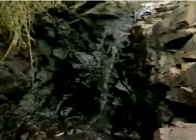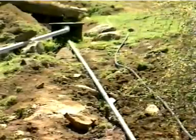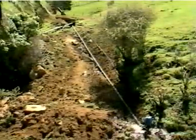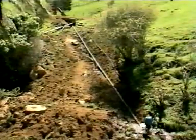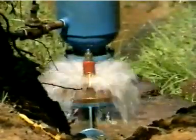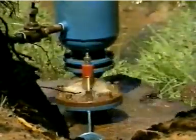However, if you've only a limited supply of clean water, it may be possible to pump it using a nearby supply of dirty water to supply the energy. There's a second requirement: the water used for pumping has to be discharged somewhere below the level you take it from. It's this fallen level that supplies the energy used for pumping. Even with only one metre of fall, you can pump water to a height of 40 metres. You can think of your Williamson pump as an energy transformer, tapping some of the stream's energy to provide you with high-pressure water. You can pipe it any way you like.